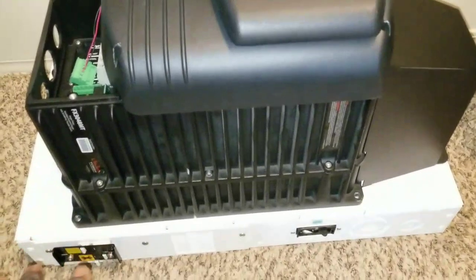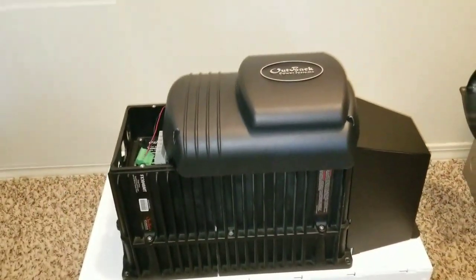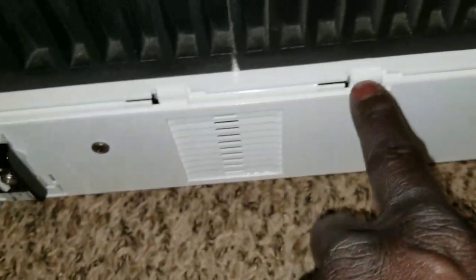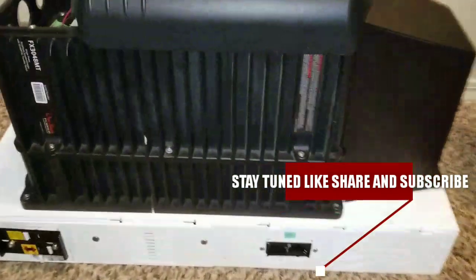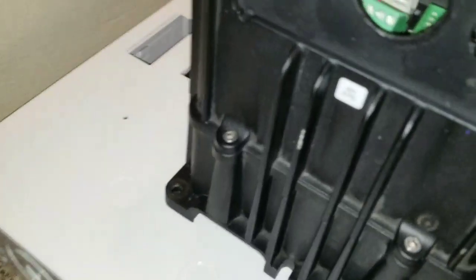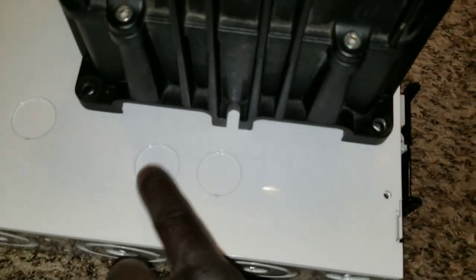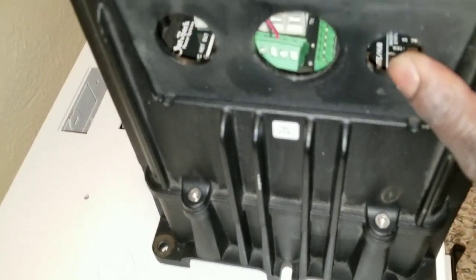Since it's a single mount for just one inverter, I decided to get the ePanel. I can open this door — it slides to the left — and the inverter attaches there. It has like wing brackets, like a door hinge. I'm really surprised these things are so tough — they hold the Outback inverter which is even heavier. The conduit with the black ones are inside the box; they sent me a brand new one so I can run them right here and keep all wires covered. You can attach the temperature sensor wire right here.